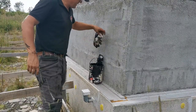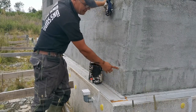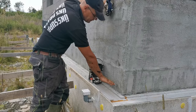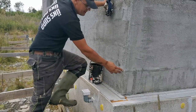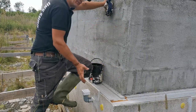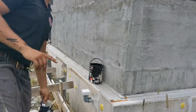One question you may ask is why I don't do it all the way to the bottom — because here is my bottom layer that is also done. So when the water rises and crawls up the wall, this is the barrier. The bottom part is here and at the moment I'm working right here so I can put down the insulation foam.